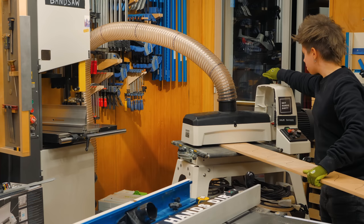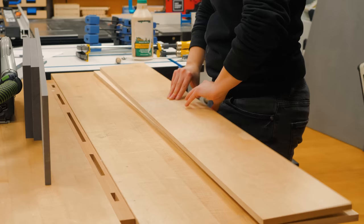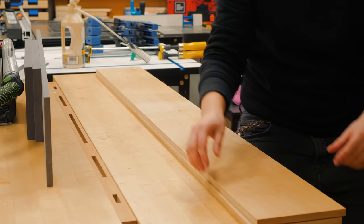The top and sides of the floating desk were made out of 19mm grey MDF, which is about three quarters of an inch. For the backer piece and the piano drawer I used pre-finished birch plywood that I had laying around for ages. I was worried that a single board would be too weak to hold the floating desk against the wall, so I sanded off the finish on one face of each board so the glue sticks perfectly and creates a thick panel.